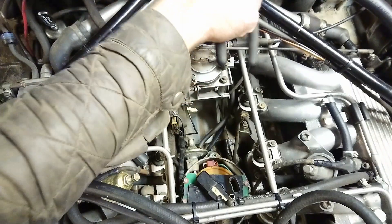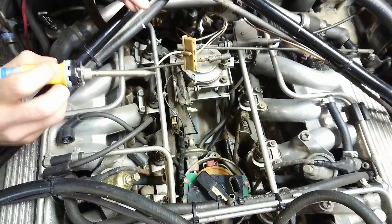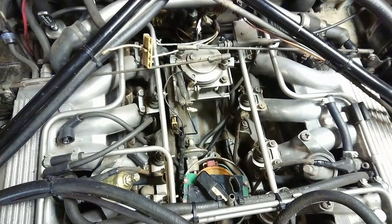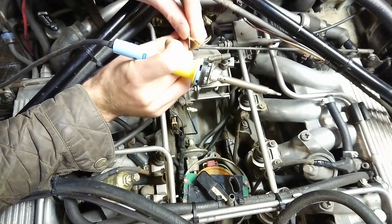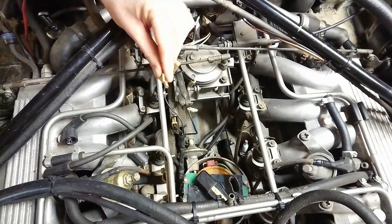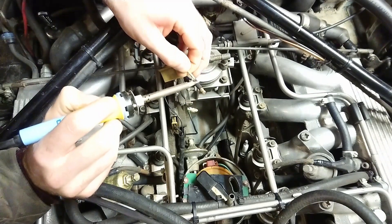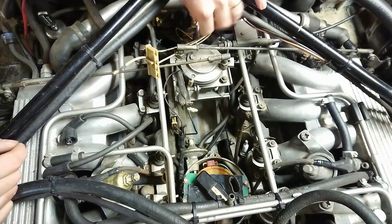There is the cable that we're going to solder to. I'll grab a nice hot soldering iron and some tin and just add a bit to the cable like so. Now I have the bullet connector on there loosely — I'll add some more solder. Once you're happy with the connection, take some shrink wrap, slide it on over, and gently heat it with the soldering iron so that makes a nice watertight connection. There's one really nice bullet connector. Now just do the same thing to the other side of the cable and then you can connect all this up.